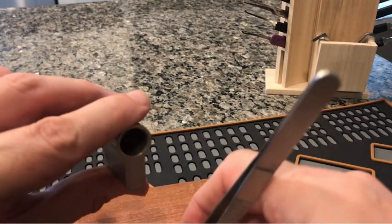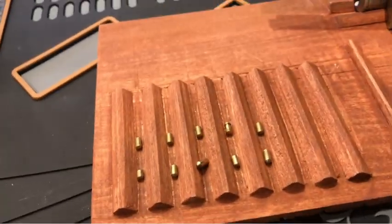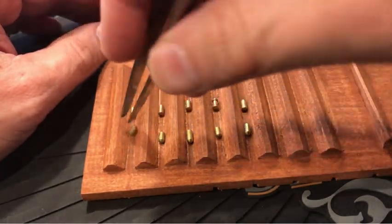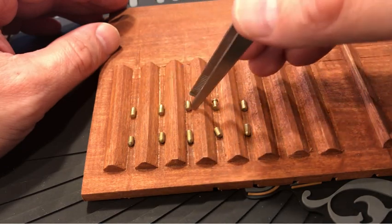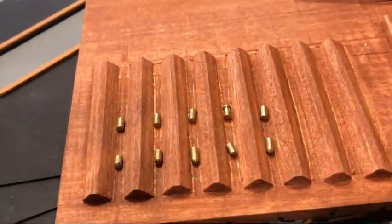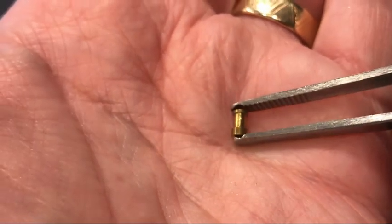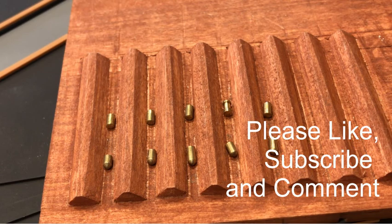Not a lot of excitement going on there, but wow, what a really sedate pick. Your key pins are all standard. Your driver pins: standard, standard, standard everywhere until we reach number four, which is a spool. You feel that spool — this lock was an unusually fast pick, but a lot of the times you get a good solid turn on the plug and then you just get up and over that spool. So there you go — your Kasp five-pin euro cylinder. Thank you very much for watching everybody, we'll talk to you again soon.